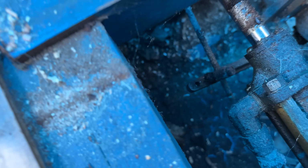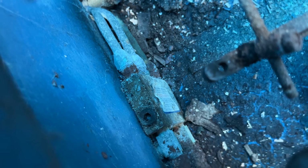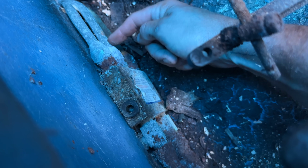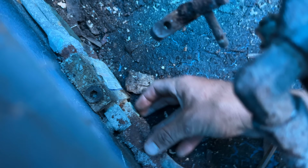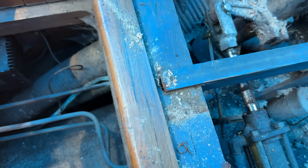So here they come. We have this little switch box. Mine is very filthy and I've got some work to do on it. But essentially what's going on here is that we've got our 2 lines from the helm and our center line, our return right there. And then after the gate, we have 2 more lines going straight to our steering right here, our hydraulic strut, and that hydraulic strut is what turns the rudder. And that's why you can't turn the rudder right now, because it's tight with hydraulic fluid.